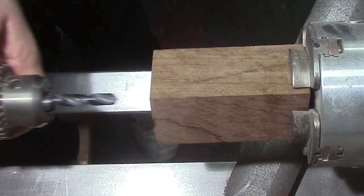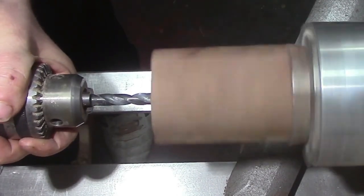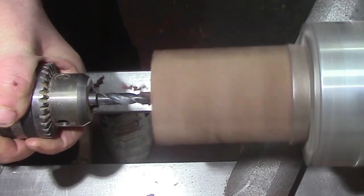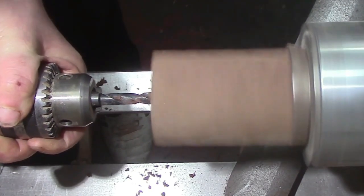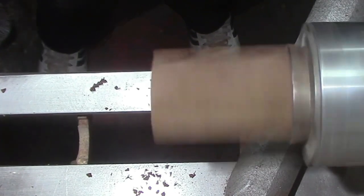The size of the drill bit we're going to be using is 11/32nds, which we use for dense woods and resins. If you're going to use soft woods it will be a 5/16ths, or you can get a threaded insert which will use a 7/16ths size drill bit.